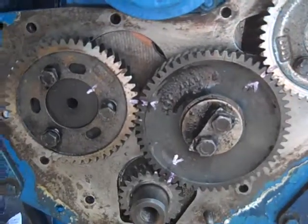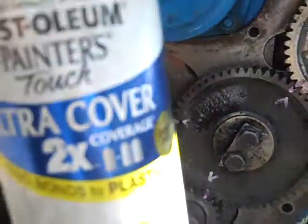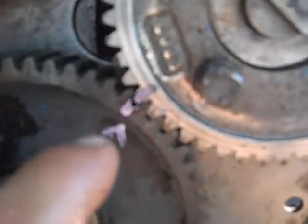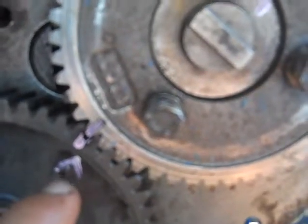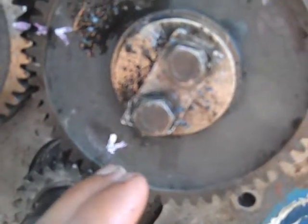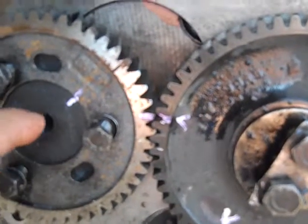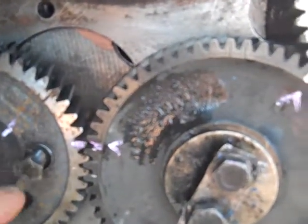The timing of the gear is very important. Using this paint, I spread it on a marker and marked exactly where it goes and the direction — the female and male sides. This goes this way, this goes this way. I'm trying to be very careful not to mess anything up. The center of the pulley is also very important to match, because this is where it goes and it spins.